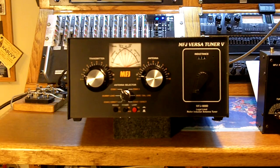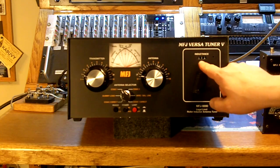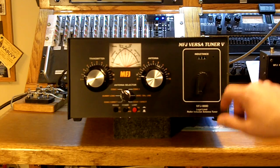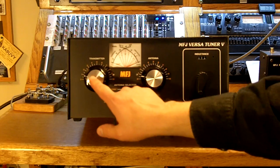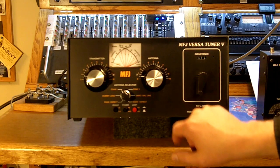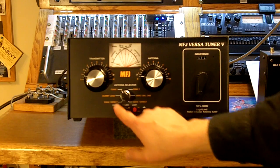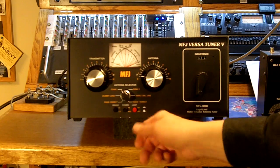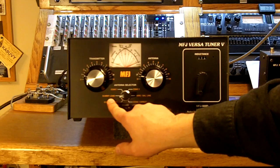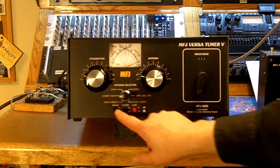Here's a look at the front of the tuner. This tuner uses a T-match, so what that means is there's a roller inductor here and two variable capacitors, and that makes up the matching network. There's a capacitor for the transmitter side and a capacitor on the antenna side, and there's a switch on the front to select from one of two different antennas. It also has a built-in dummy load on this model, so you can tune your transmitter before you actually apply any power through the matching section or to an antenna.